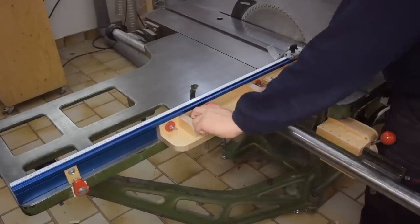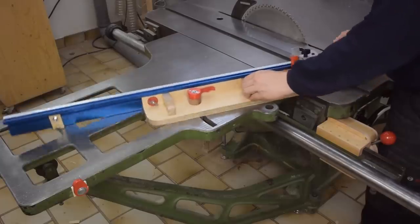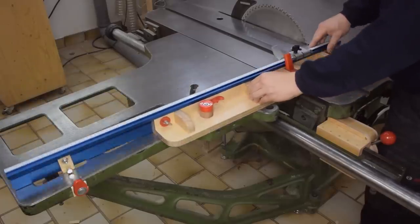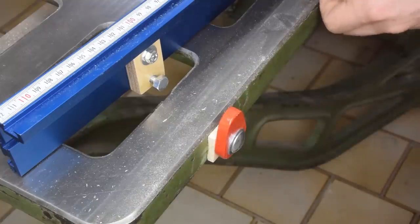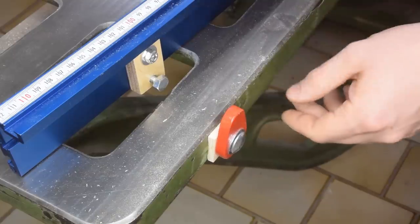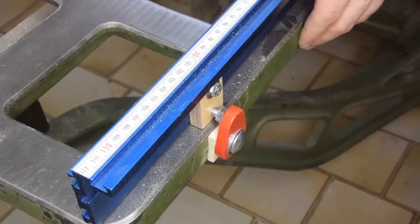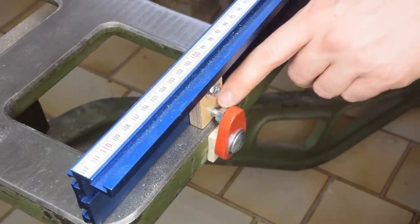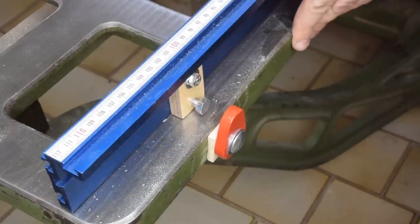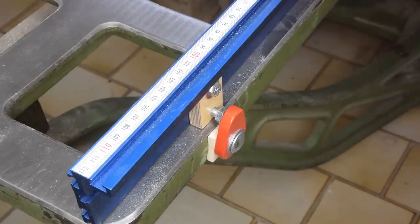The fence can be tilted a little more than 45 degrees forward. It has a flip up 90 degree reference stop, spring loaded with a very strong spring so it will always stay tight. One turn on the adjustment screw is about a tenth of a degree. This is not a hard stop — it's just a reference point — so you need to be a little bit careful and not yank the fence into position. I didn't have to drill a hole in the casting; the hole was there before, possibly for this very purpose.